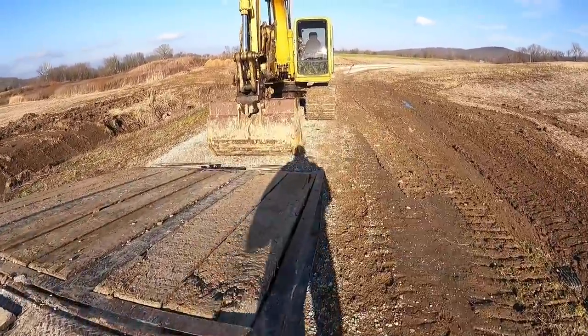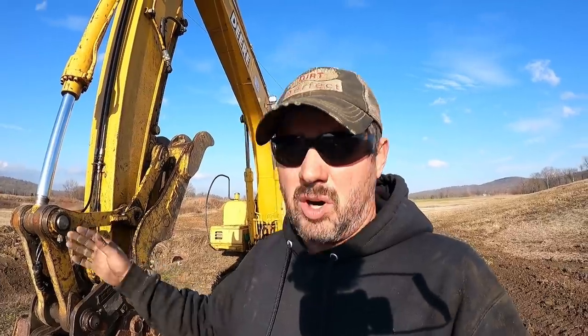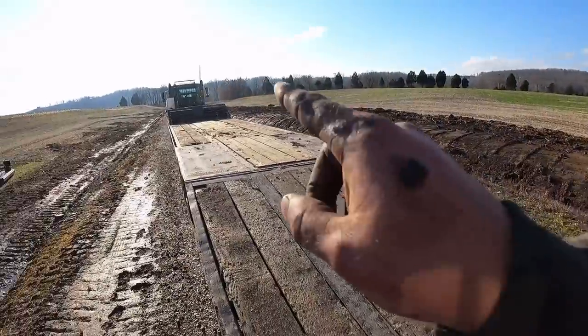Now that we've got our transport vehicle ready to load, there's one more thing we need to do: make sure the transport vehicle is legally capable of hauling the weight of the machine. This can vary greatly across the country and around the world. The best thing is to ask Google, because the last thing you want is an equipment failure due to overloading or a hefty overload fine. Some quick math and a little research and you'll know whether that machine fits on that trailer.